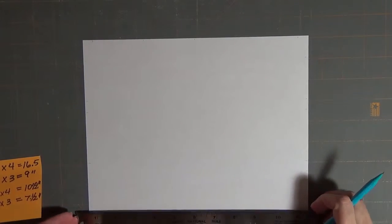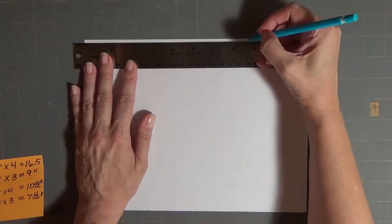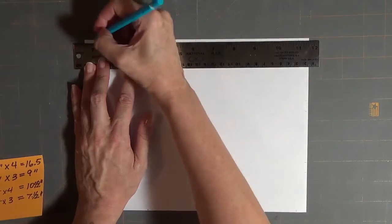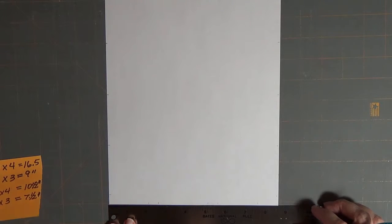We're going to repeat this on the other edge very precisely. ½ inch mark, 2.5 inch, 2.5 inch, 2.5 inch, 2.5 inch. Now we're going to do along the width of the box. It's going to be straight 2.5 inch measurements. There are no tabs on the ends, but there are going to be some interior tabs along the length.